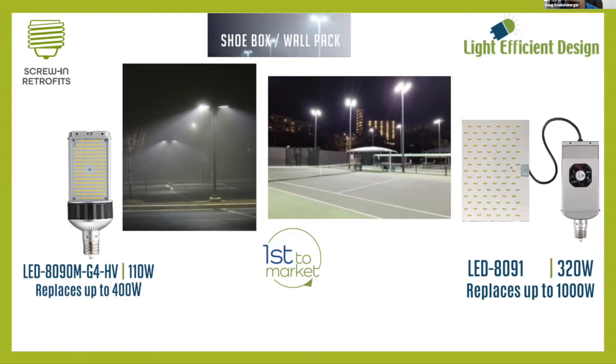Step one is that you're going to adhere this LED panel to the lens of the fixture. There's a 3M adhesive. You peel away, and then it exposes the 3M adhesive that helps the installer mount it easily to the lens of the fixture. The 3M adhesive also acts as a heat sink, helping dissipate the heat away from the LEDs.